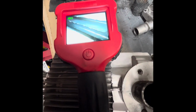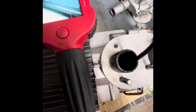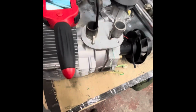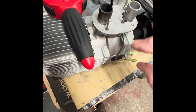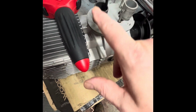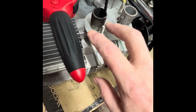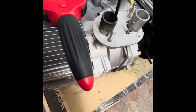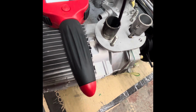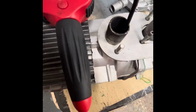Okay, yes, it has an afterburner in there, but how can it run that clean? Instead of the normal flexi piping for the exhaust, I have a very nice bend on it, made of copper, so it still clamps on nice and tight. Then I go into not the Chinese exhaust, I use the Webasto exhaust with one bend on it, and the silencer's clear. That's as clear as anything. That's quite amazing.